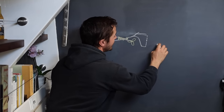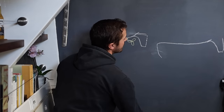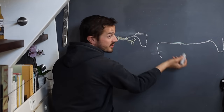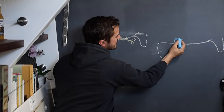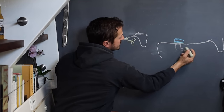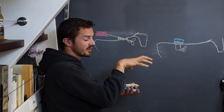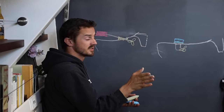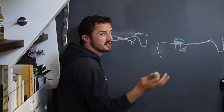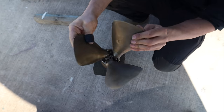The beauty of a sail drive is its simplicity. We've already glassed in the ring where the sail drive is going to sit. All we have to do now is cut a hole underneath that ring and then install the actual motor, which will sit on top on a flange and bolt the skeg underneath — to which the propeller gets attached. Aligning a system like this is much simpler because it's all one unit. You just have to make sure it's relatively level to the boat's waterline and parallel to the keel, and the alignment issues we had with a shaft drive are pretty much gone.